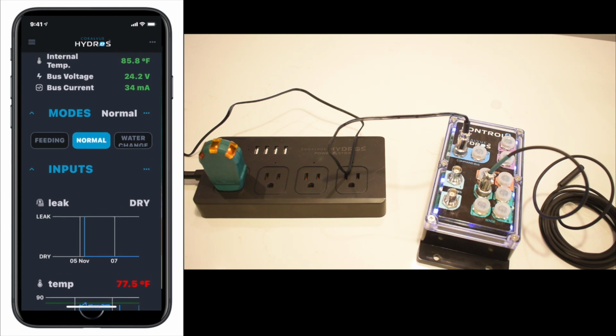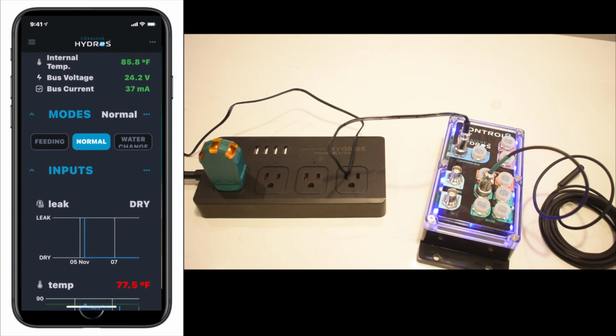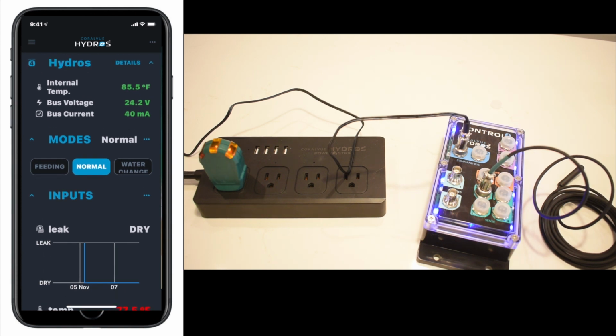Okay, so a couple things that are out there that I want to mention. One thing is the system is not 100% wireless, and what I mean by that is if you wanted to control something in another room, you would need to purchase another Control4 or Control2 unit. Now, in order for those to be on the same system, you would have to control them with a command bus cable. So they do not control each other via wireless. Now, they will if there was possibly a power failure to one. So if one lost power, it then would take over on the other Control4 or Control2 unit. And they basically will essentially override the other one. So if something was to go wrong with one, the other one's going to take over. But again, you need to have a wire, so it's not wireless.